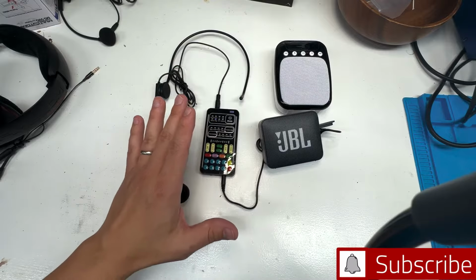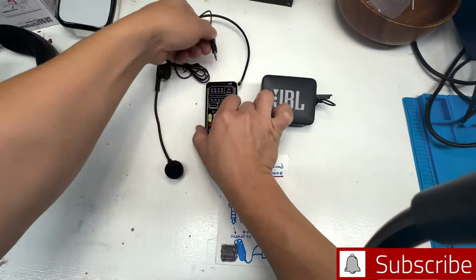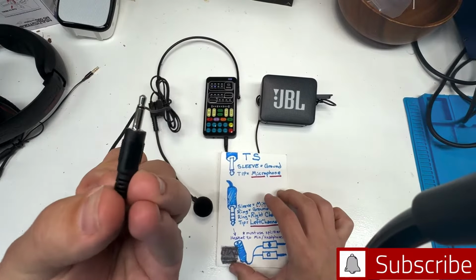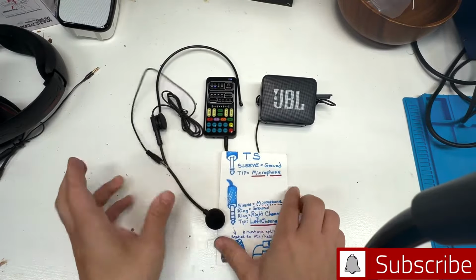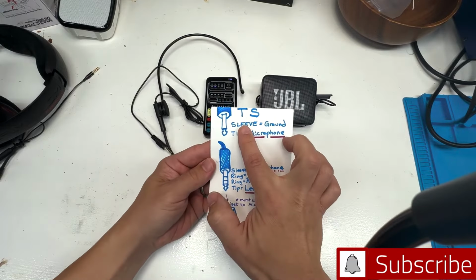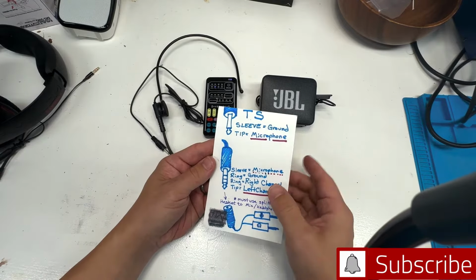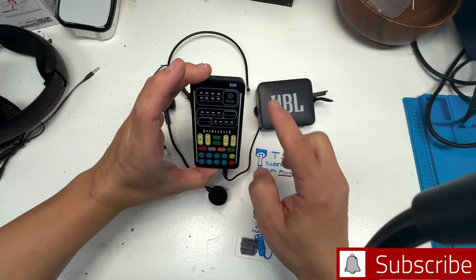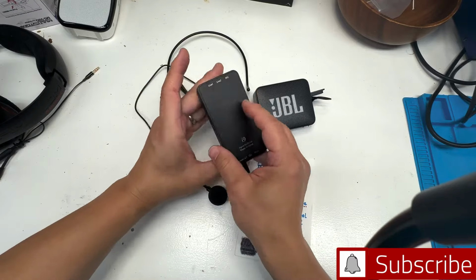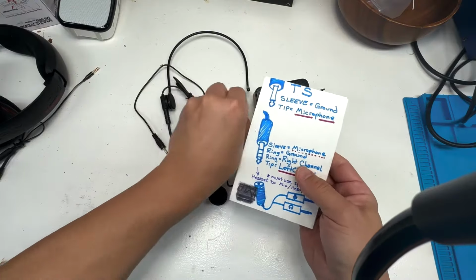This is where I'm going to do a little education lesson here. Here's your different connector types. So this one, what's that look like? That's a tip and a sleeve. Your sleeve is your ground. Your tip is your microphone. The tip is the important part here. If your microphone is going into the mic input and it doesn't have a tip that's a mic, it will not work. Two different types of connectors come with a microphone tip, either a tip and a sleeve or a tip ring sleeve.